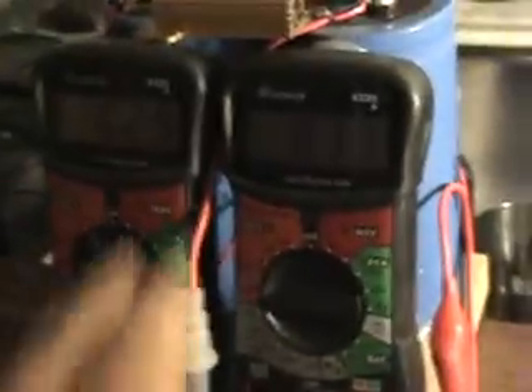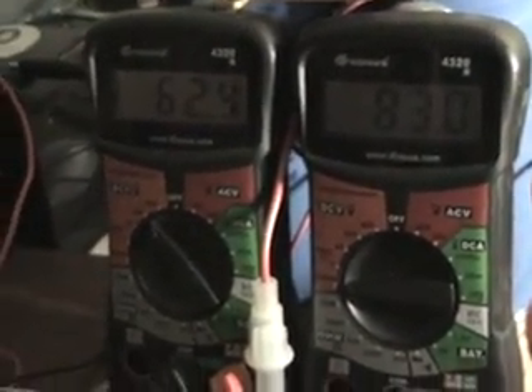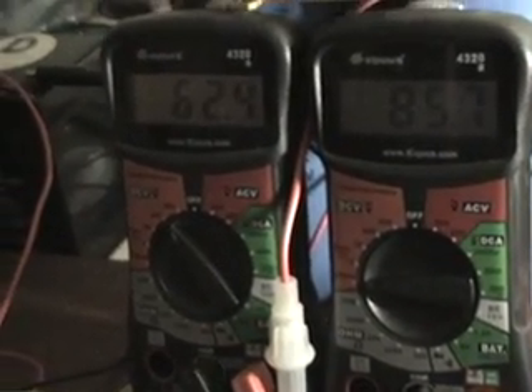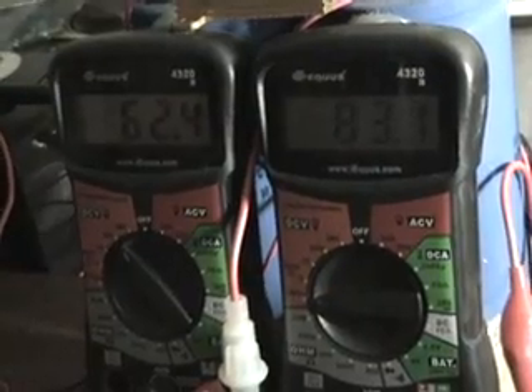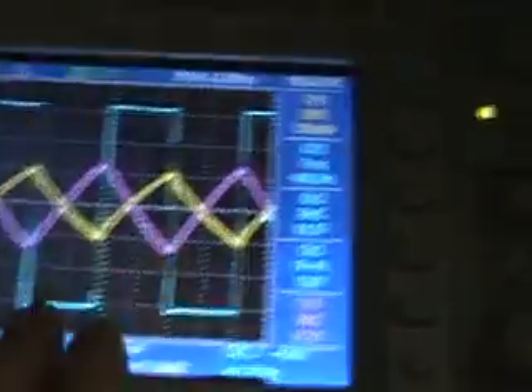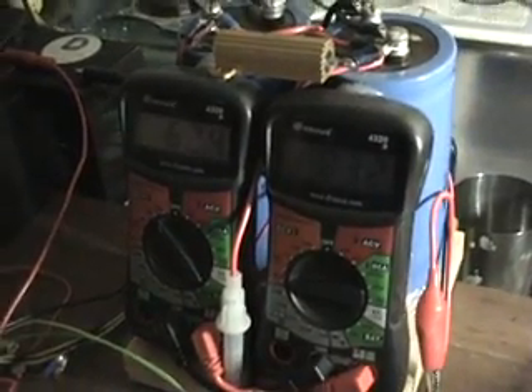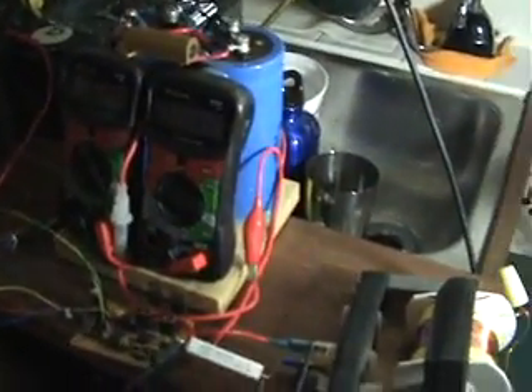If we look at my meter on the DC side, prior to the H-bridge — which is the feed to the input of the H-bridge — if I disconnect the load, there's no change. Connect the load — exactly back at the same thing. Disconnect the load — there's no difference. So as far as I'm concerned, this source current feeding the whole thing is really what is important. Maybe the experts can figure out why that is happening. If somebody can do all the math on that, that would be greatly appreciated. Thanks for watching. Bye now.